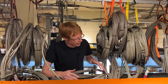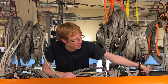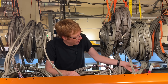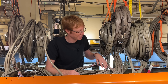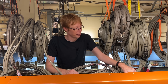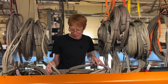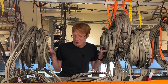First on our mind is getting the power and the ground. These big copper handles are actually where the main battery feed comes in. It has two different battery feeds — an A feed and a B feed — and we'll mount a big copper wire to each of these. There's also a big copper bus bar that has the return, so that bar is grounded. Step one is wiring everything to these battery and ground connections before we can deal with the litany of other cables that we need to send to the right places.